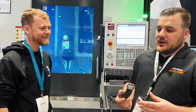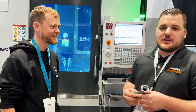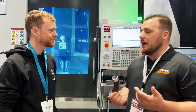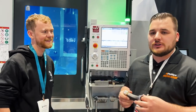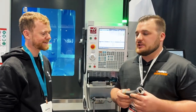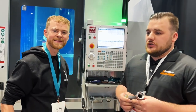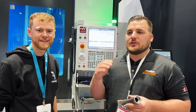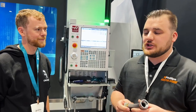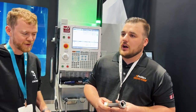We have a laser process with six lasers and we're using standard welding wire as our feedstock, so we don't have issues with powder that you'd normally have. A powder-based system requires worrying about material changeover, there's a lot of waste material, and there are health risks requiring a special respirator. Using commercial welding wire we're able to use more cost-effective material, we get over 90% material utilization, and material changeover takes just five minutes to switch from one wire to another.